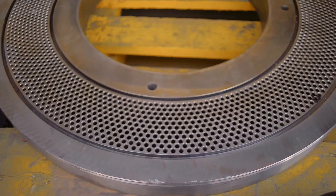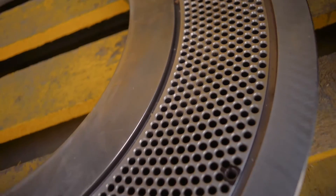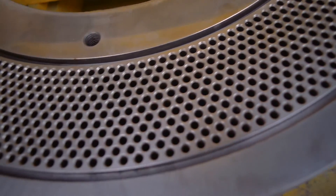The most common pelletizers are of two types: a flat die and a circular die. The die is a large ring made of hardened steel with holes through it, driven via a gear drive from the main electric motor. Inside the die, there are two rollers. They rotate around their axis and are driven by the material, which is sheared between the rollers and the inner surface of the die. As a result of the pressure, the material is heated to a temperature of 100 to 120 degrees Celsius, and the lignin is softened.